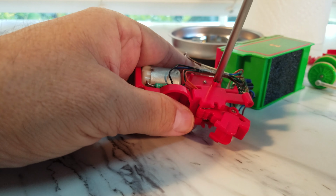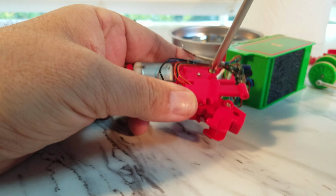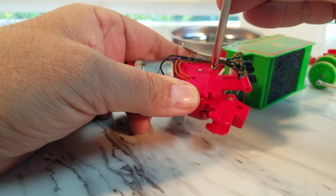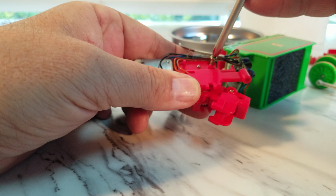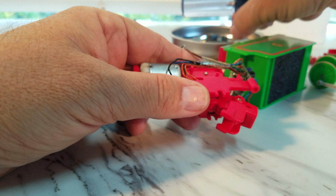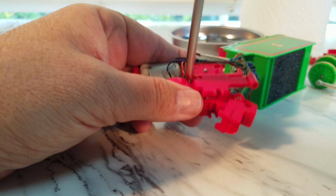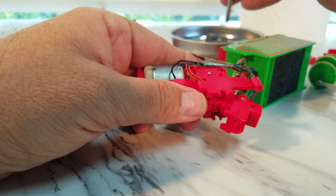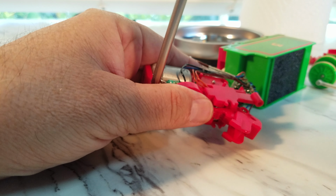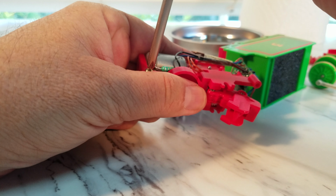And use your hand underneath. You don't want to put pressure against the train parts against your bench you're working on, or you'll break components on the other side. All right, taking the 3 screws out right here. Now this was actually pretty scary the first time I did it, but I'm pretty used to it now. Especially the first time when I was trying to figure out how in the heck that whole thing went back together.